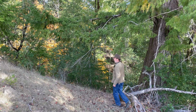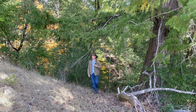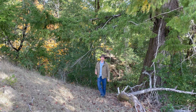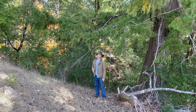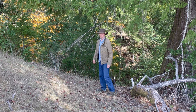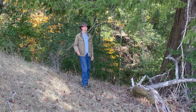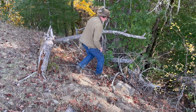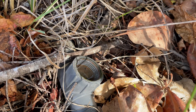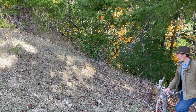We're back at the top of the hill where the pipe comes up through the prairie, then goes down over the hill to where the water is. From this point the pipe goes downhill until it hits the creek bottom, then it goes up more. According to my altimeter, this spot is about 40 feet lower in elevation than the source, so we have 40 feet of head to push the water up the hill and over this hump. But sometimes when you open up the lines, it lets air in — you get air bubbles in the system and it prevents flow. Over here, right at the top, there's a T in the pipe with a plug in it. I'll take that out and see what happens — nothing happens. There's water sitting there but no pressure to push it out.